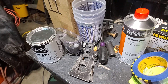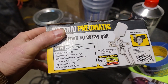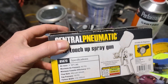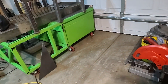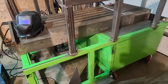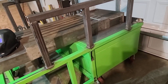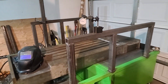It's a four-to-one mix and you've got to mix it and use it right away. This stuff requires a point-eight nozzle — really just a touch-up nozzle — because you're putting on a really thin layer of paint. For just doing these metal parts, since I'm not doing large surfaces, I'd rather use a small nozzle anyway, otherwise I'll have overspray like you wouldn't believe. So I'm going to have to cover up my t-slot table before I do this, and that means tape and newspaper. Anyway, that's all for now.